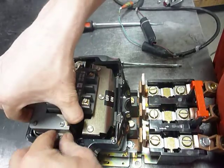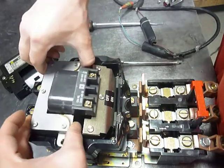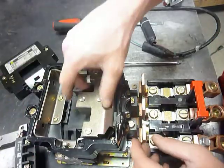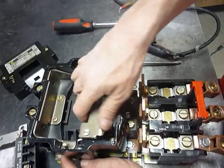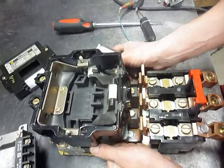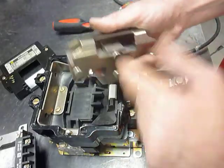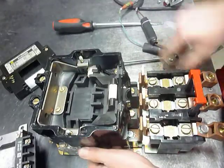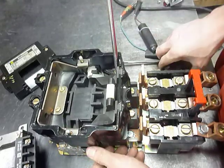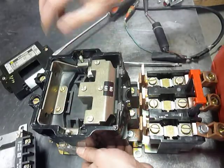Take care of the washers — they're here. You can actually get the upper and the coil out separately. But if you take out the lower half to release it, you can push down on that armature as seen in the other video. The cavity just has to align. A quick trick is to place a screwdriver here and sweep the coil with the armature.